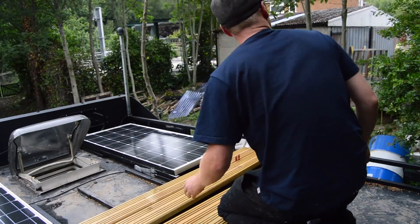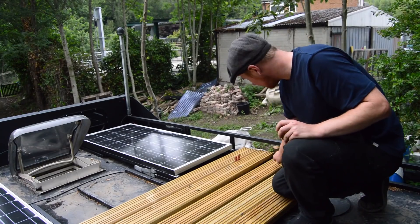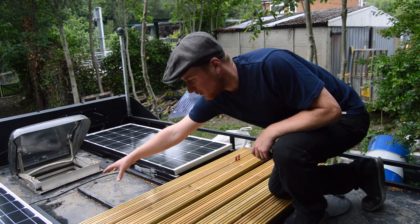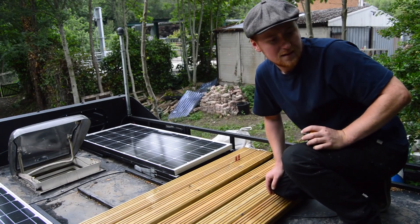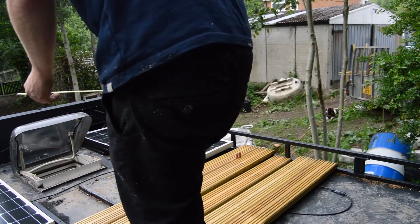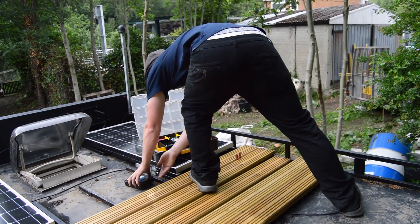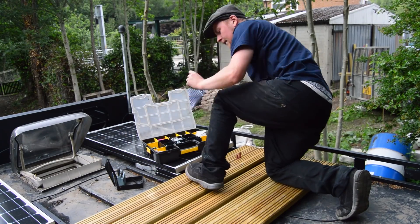A few of these boards are going to need little divots out of them. Certain bits are going to need modifying and tweaking but overall it should be quite simple - two or three little ones there, spread over here, full length here and then it will go around and under the ladder. This step was fairly straightforward and went together like clockwork. Tim was downstairs cutting the boards to size and I was upstairs measuring up and fitting, using Tim's spacer method so I got an even gap between each board all the way down.